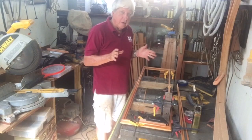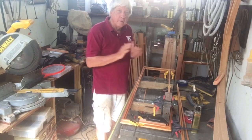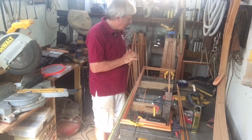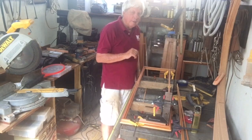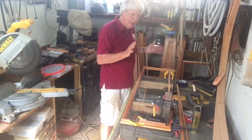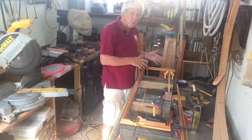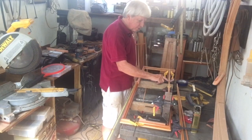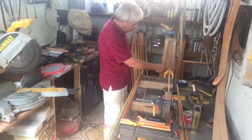Planned it out perfectly, and as soon as I put the plan in place, it all went to cock. So I finally sorted it out, and I'm sparing you that trial. Basically what we're doing is we're putting the back piece in and one side piece, which will square it off. I put dabs of silicone in five spots on the big piece and all across the bottom.